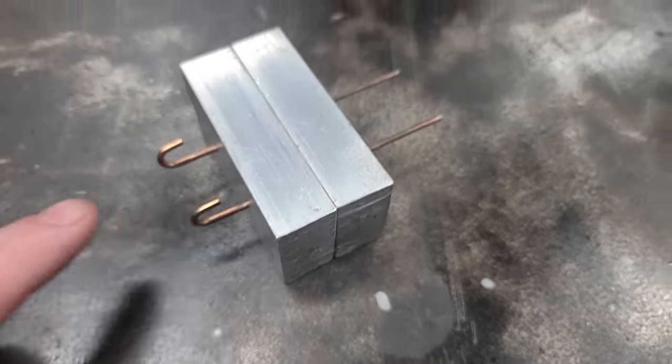So this little part that it leaves over, and what I mean is your pour hole part, you can just clip it off with a pair of dykes, and after you clip it off, you just throw it back in your lead pot. And when you're done, this is what you end up with, and you can kind of see the difference. This is a sinker that was made with just a drill bit. I mean, it don't look that bad. This is the sinker that was made with the round ball end mill, and it looks a lot like a regular egg sinker. It's kind of cool.